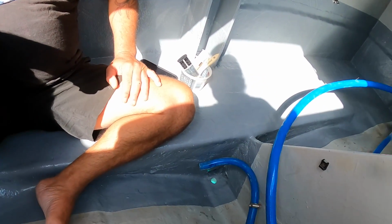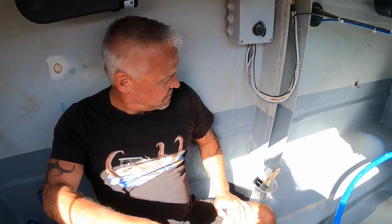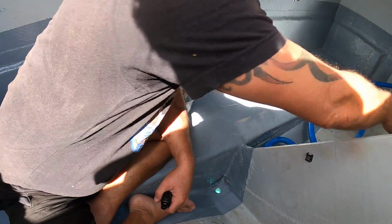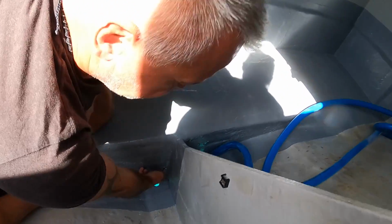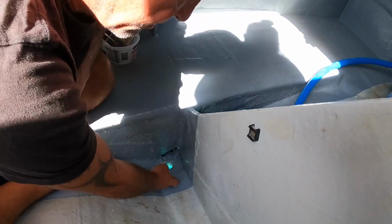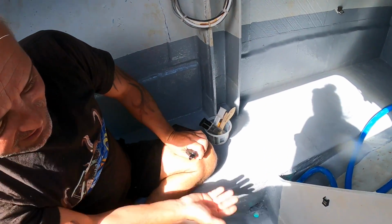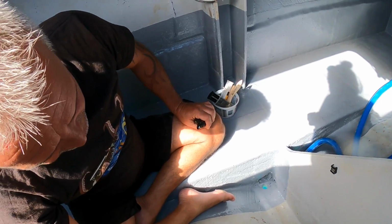And you were going to do the hole down there. Yeah. So what was that for? Drainage. So that's what Lagoon came and did. But Lagoon, their fix that they had somebody specialist come and do was to drill a hole here to allow any water that was connecting up in here to come out. But the thing is, it was so high up, it left about 2 inches of standing water in there, which had been sucked up in all the wood. So their fix isn't very good.